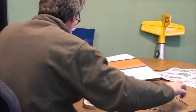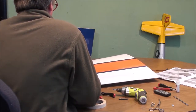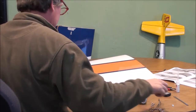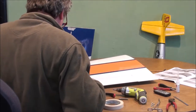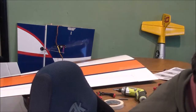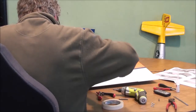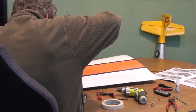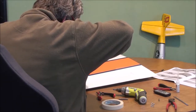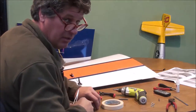I clip it. When you clip these, be very careful to hold on to the other end, otherwise it'll shoot across the room. When you pop these clevises loose, they're kind of tight. What I do is take my hemostats, put them in between the clevis ends, and then roll them over — they'll pop that end loose. Then you can take the other end and pry it out very carefully, not to damage your hardware. It makes something hard fairly easy.